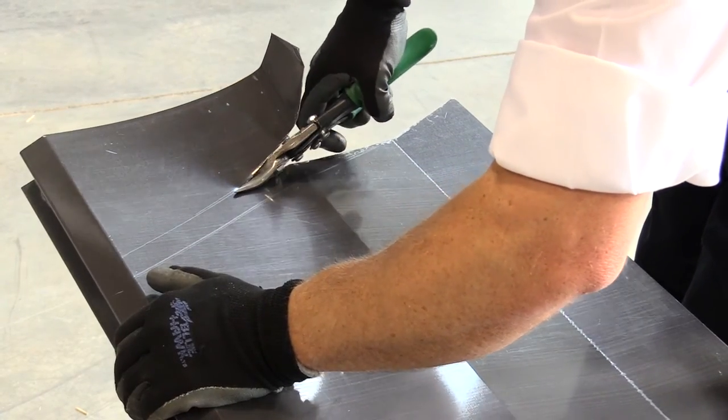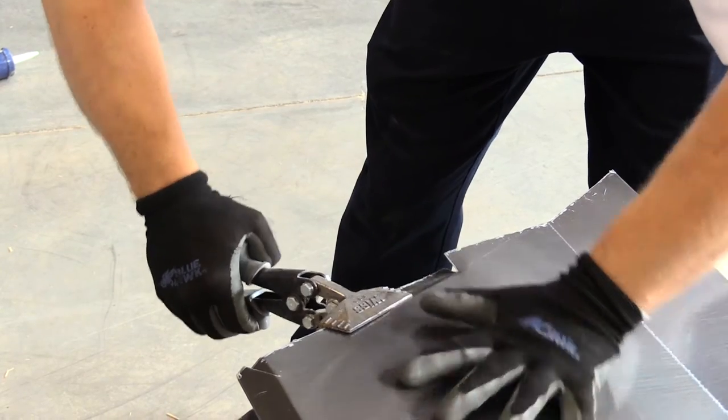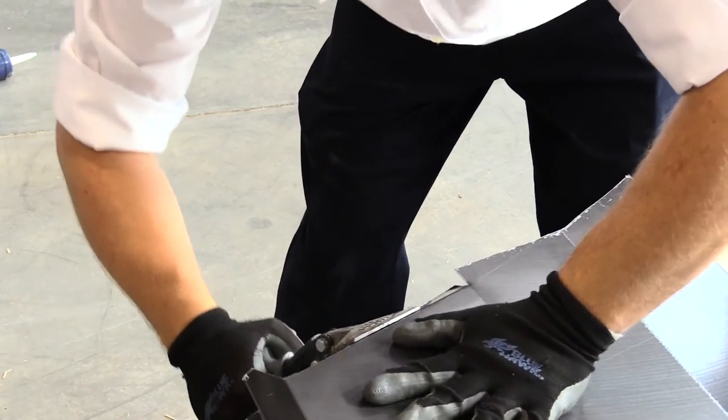In a standard installation, ensure proper water protection from the roof by using valley metal, counter flashing, step flashing, sealant, or any other common roofing material to properly funnel the water away from the exposed roof deck.